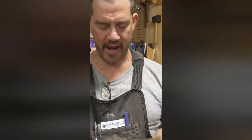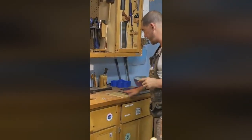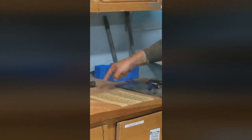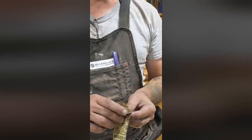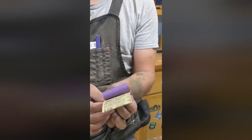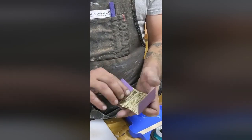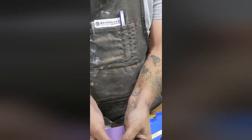So this is the way that I use to optimize sandpaper — I hate wasting money on sandpaper personally. First, I cut it the long way, I've got a little thing set up here so it's always kind of straight. I cut it the long way, and then fold it in half like so, open that one up, fold that one down in there just like that, fold it in half again, take that, open that up just like we did with the first one.